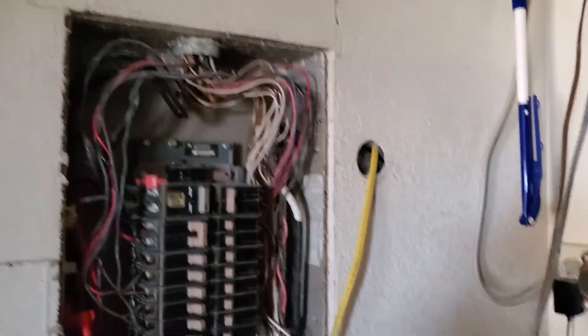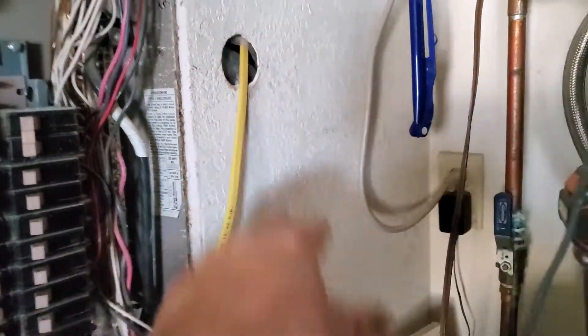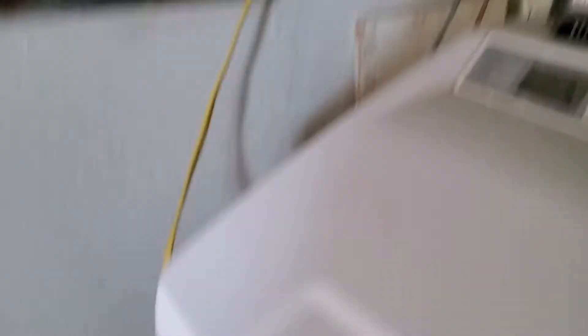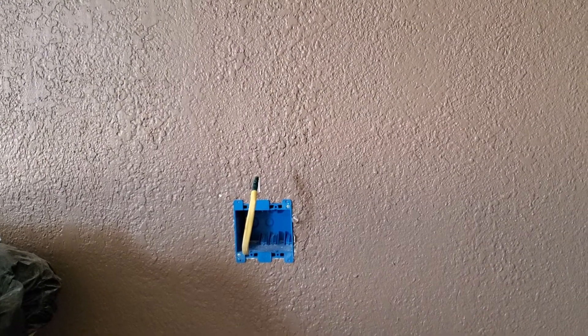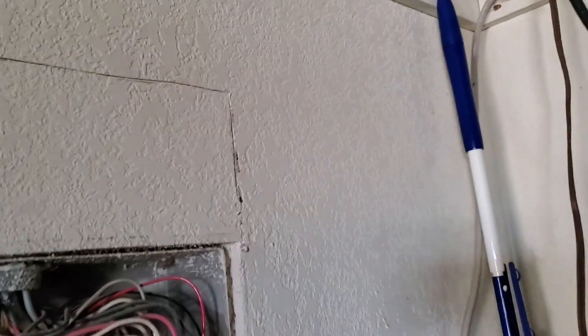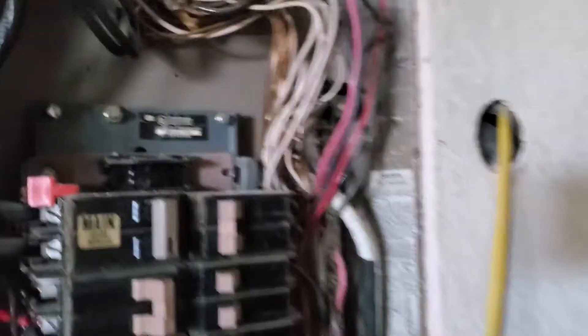I made sure the panel was closed at the time. There was already an access hole here that I was able to fish up more coat hanger, and from up top once I got that wire up there, I attached the appropriate wire — in this case a 12-2 for the 20-amp breaker — and fished it through. I made sure I was able to get it all the way up into the attic, tied the end of the wire to it, and basically pulled it through. Once I open up the sheetrock here, drill a hole across this stud, and bring it back through, you can see there are some knockouts in the panel where I can get that wire in and wire it appropriately.